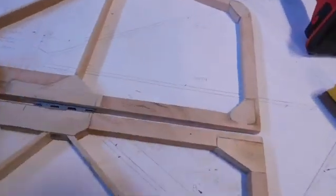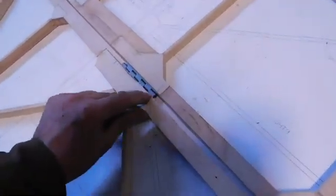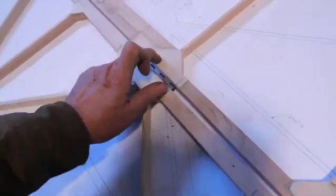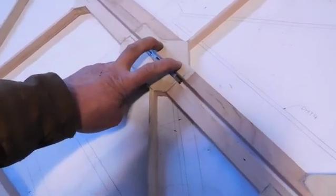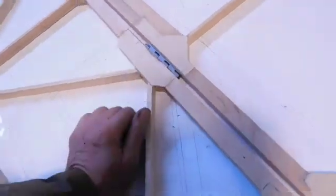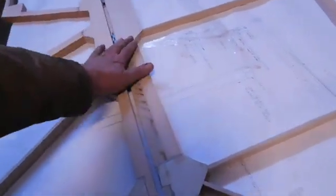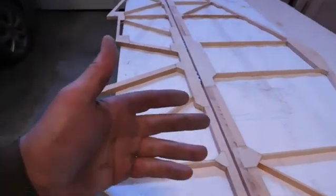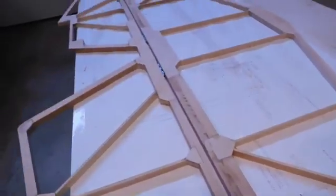So now I will drill the holes. I'm not sure what everyone's doing here - I've crimped the pins so they're in there. I'll probably mount them on the horizontal stabilizer so that they would be permanent there, then cover over top and then cover this separately and add it. What's everyone doing with the covering on theirs - whether they put the hinges in on the elevator or on the horizontal stabilizer, or the elevator and then slide the other one in after its fabric is on it and then bolt them through?